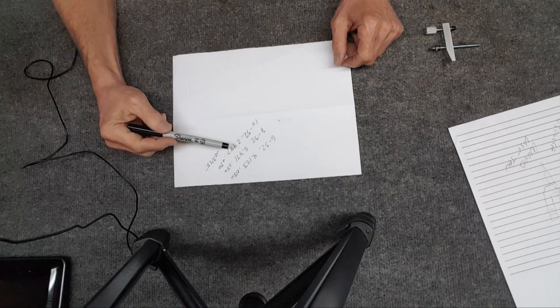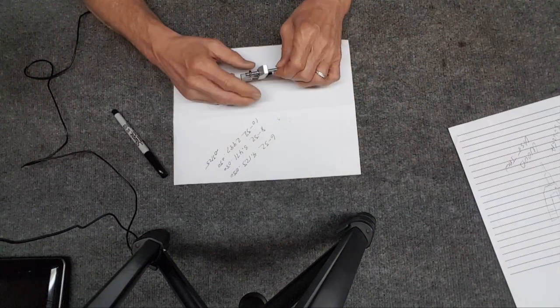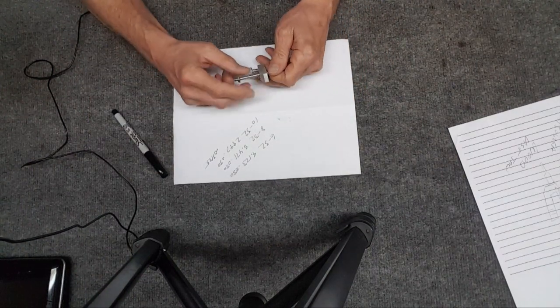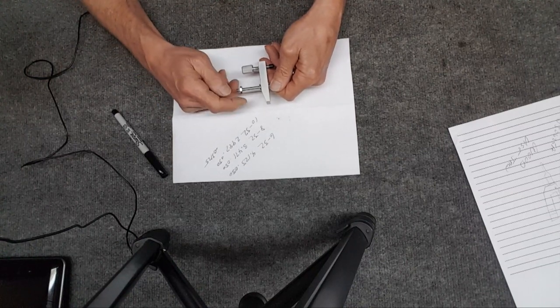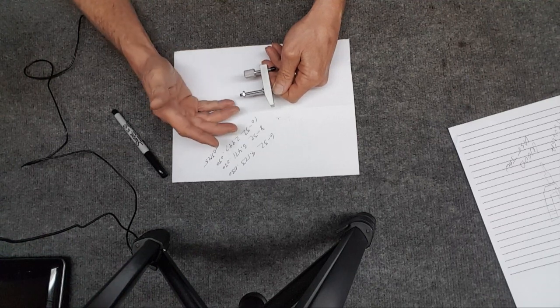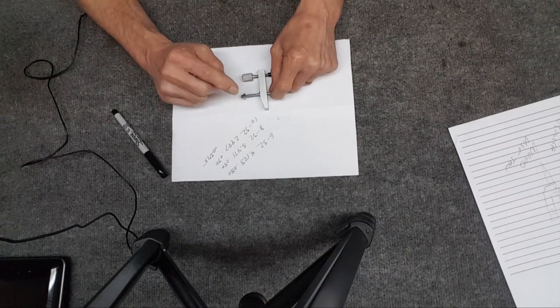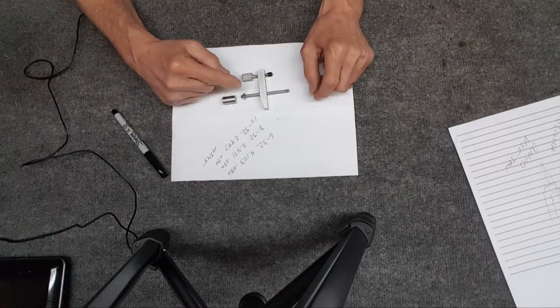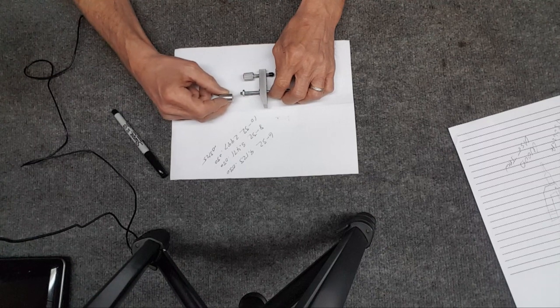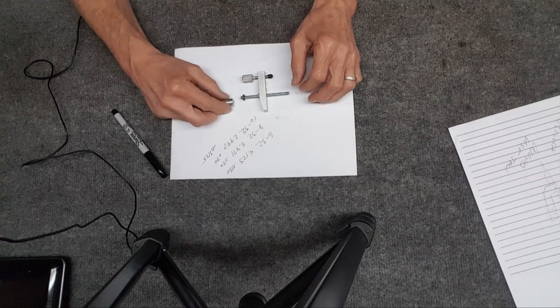So right there, the lathe is not going to account for the helix angle. When does that come into play? And I did experience it, I believe. When you just have a nut, you can't see here, but there's a lot of play in this, and you have what, three or four threads engaged, so it doesn't really make that much of a difference. When it does impact you is when you're trying to put something long on there. If these angles don't match, then it's going to go on so far, and then it's going to jam and won't go on any further.